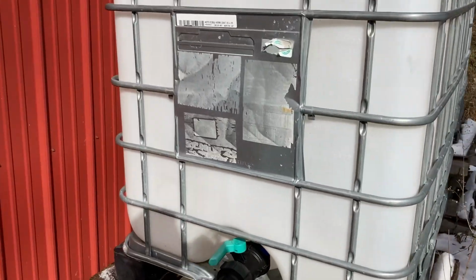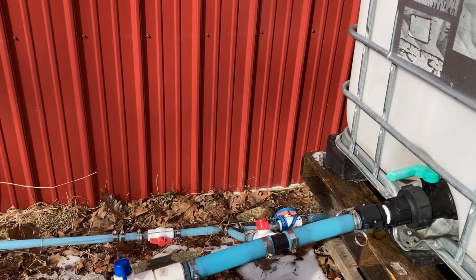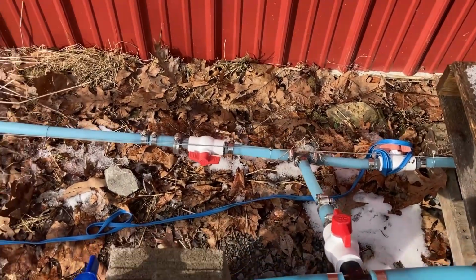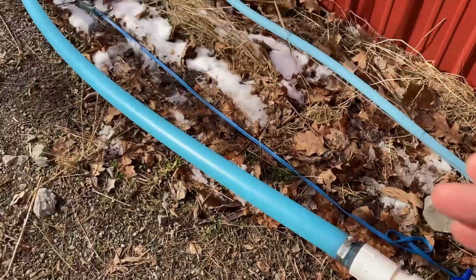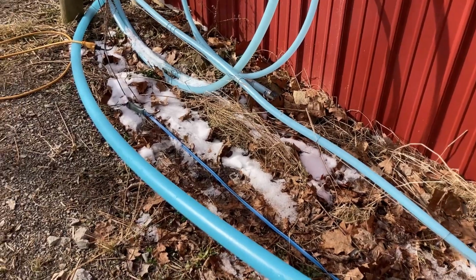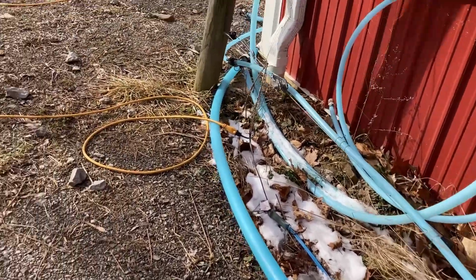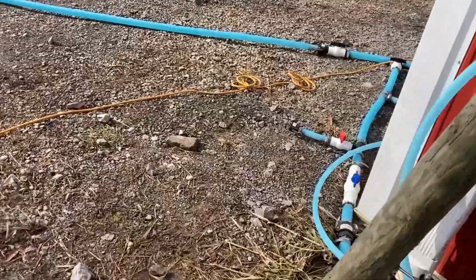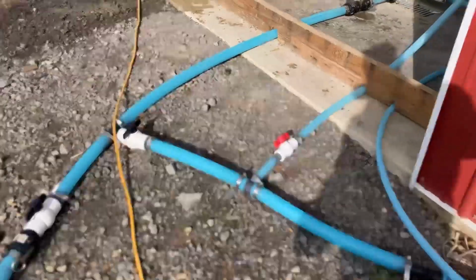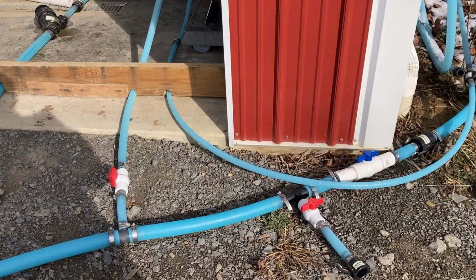After it goes through those and shuts off from that big bulk tank, we will run this, open this back up, and have the concentrate go back through the RO again to give us a higher concentrated sap. And that has proved to be very efficient. We use less wood in the process to burn the sap to get syrup, and has also proved to be an efficiency of time.